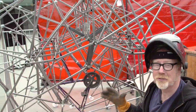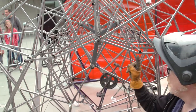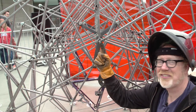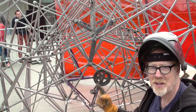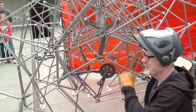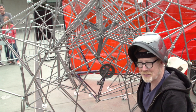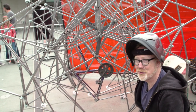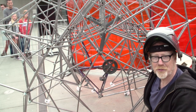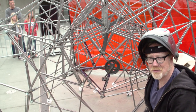All right, so here's what I have just done. I have just taken this, which was a straight line, made a couple of weakening cuts, and pulled this entire center pivot of the crankshaft 3.5 inches up. You can see it's now more like a cathedral. This is just one measurement I forgot to put in my book when I started planning this, like an idiot. I never double checked. Hopefully this is enough to get this thing going. I'm about to give it its first push, and hopefully I got rid of that hitch that was keeping it from going forward yesterday.